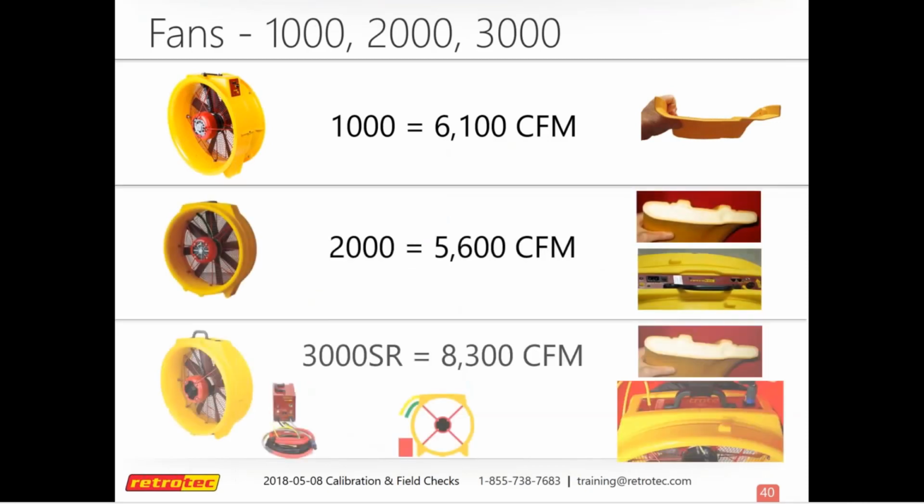As you guys know, we've had several different blower door models come out over the years. Different designs call for different ways to inspect for motor alignment and fan blade clearance. Some of the older models used to have the old foam-filled shell. Then we moved to a lighter weight shell that's a more sturdy plastic.